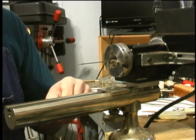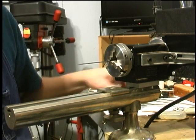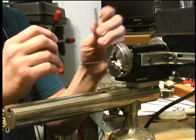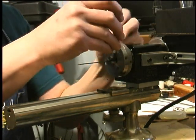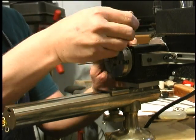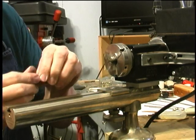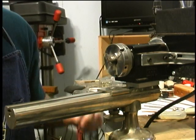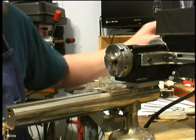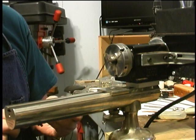So let's say we've done all this and we still can't quite get it to fit. We still have another option. We could make a new rod of a slightly smaller diameter. We could use some fine sandpapers on this rod and try to sand it. We could figure out just exactly which area is sticking by where it fits in the key and sand a little bit with fine sandpapers. We could also ream the key out a bit, and I'm going to show you that now.